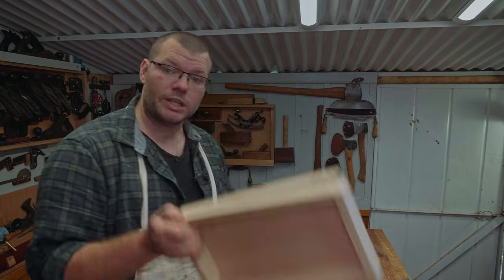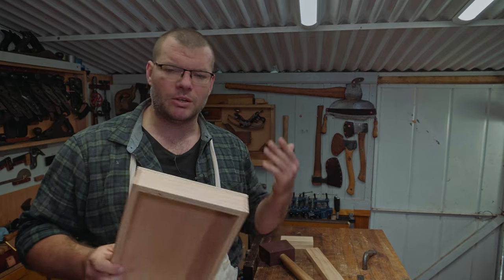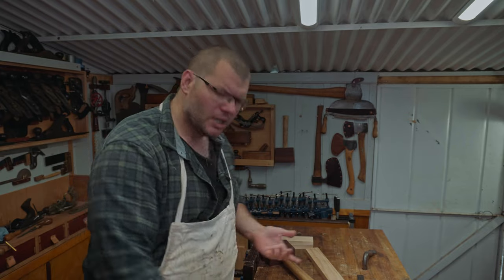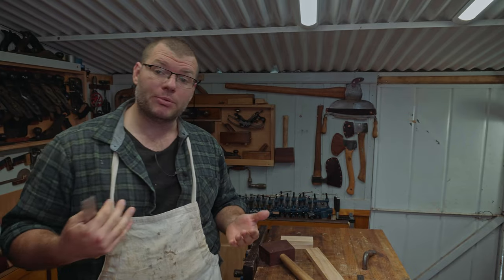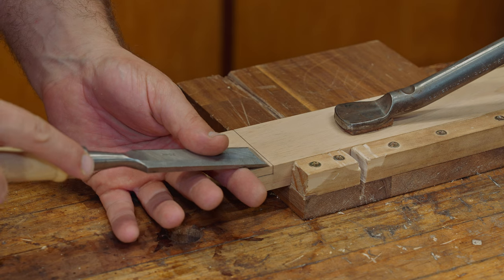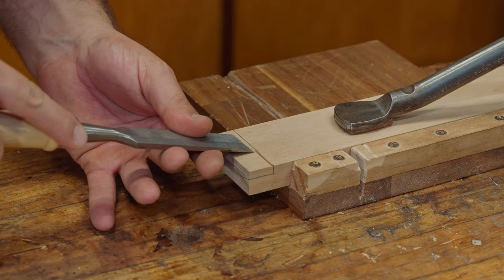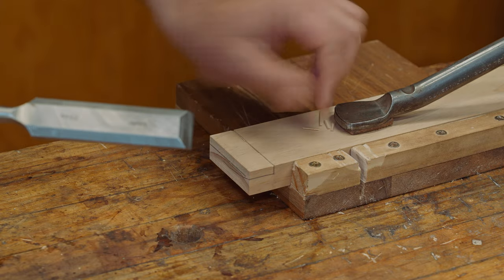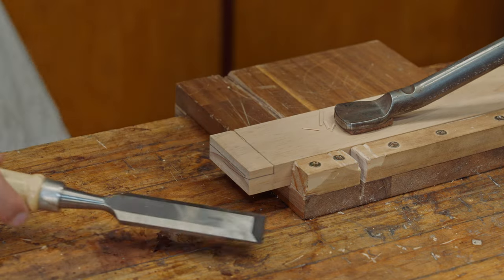This process is fairly quick and easy — it's the same process we did in the last video. I'll leave that link down below, and the beginner video where I showed you how to do this. We're going to be using the hybrid approach — using a saw and a chisel — to get these rebates complete. As always when I do these, I push back against the knife line, forming a little wall.